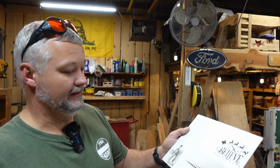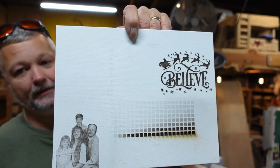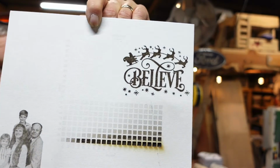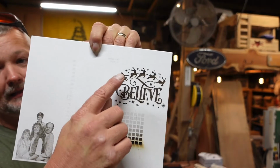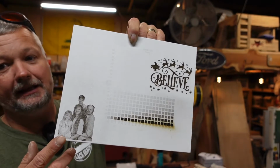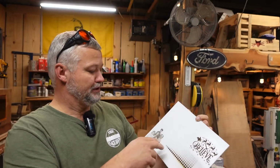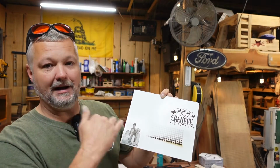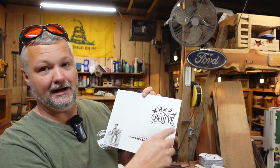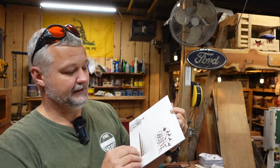There's your settings. Like I said, this is running a 10 watt, and I was particularly running the Ortur Laser Master 3 10 watt. And the power settings up here, 55 millimeters per second at 100% output. Same thing here. This is a little darker because when you're doing an image, the power goes up and down all the way across. This is more of a continuous power flow. So this one's a little darker, got a little deeper, but for text and stuff like that, I think that'll look good.